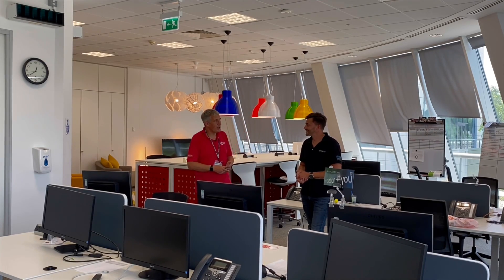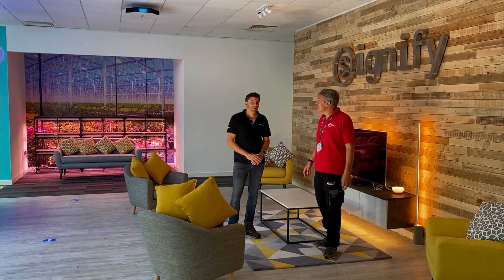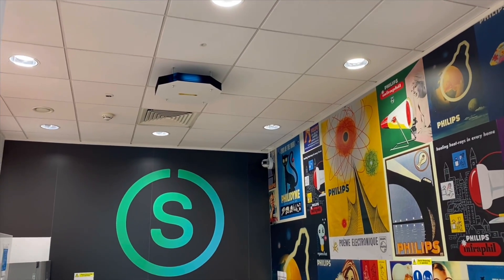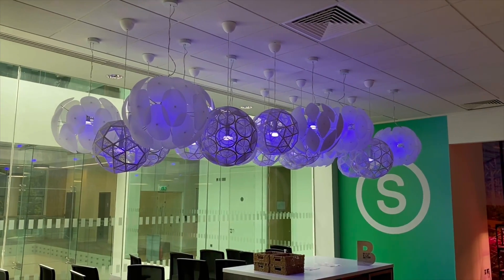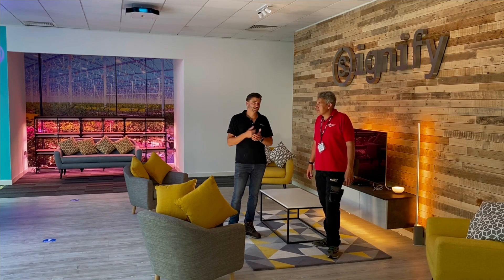In the breakout zone, upper air UVC lights provide a 360-degree output against the ceiling. They've also been installed in the cafeteria area. With pendant light fittings hanging from the ceiling, those had to be accounted for within the laser range, making sure the whole area is covered and masking out certain areas if needed. Additionally, if anything changes in that space, the system will need to be recommissioned to make sure the sensors are covering the right locations.